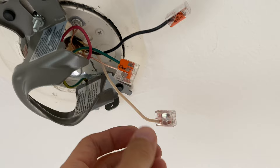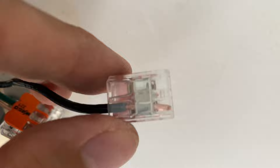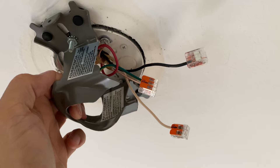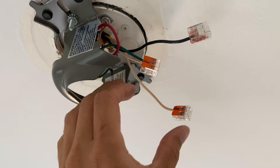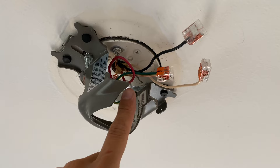The bracket is now installed on the box on the ceiling. I also wanted to show you these wire nuts I like to use — they're called lever nuts by Wago. It's as simple as putting the wire in and flipping the lever. They're so much easier to use than regular wire nuts, and the clear ones let you see if the wire is in all the way. I found a YouTube video of someone running a current test through these, and I could not believe how much current you can run through them before they even start showing a problem. Once I saw that video I was convinced — I use these for everything now. They provide a very secure connection without having to twist your wires. With that Hunter fan model, it only needs one power connection, so I put a lever nut on the extra wire just to keep it from touching anything.